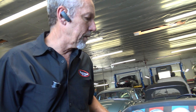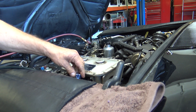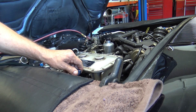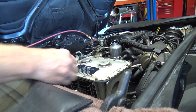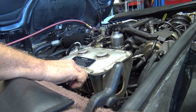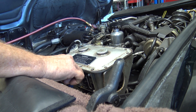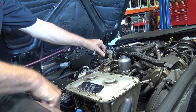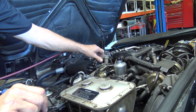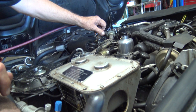Is there anything about that valve there that was loose that we need to do? I tightened it up, so you should be good on that. We're full-on Freon — you've got a full charge. Any tension issues with the condensing? No, I don't think so. I think it's all in this valve, because we did get something to change. It's just got too high a pressure.